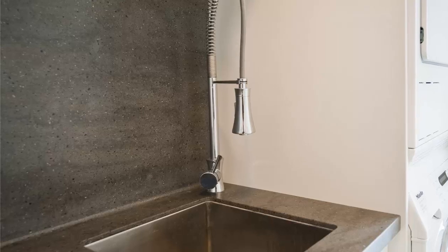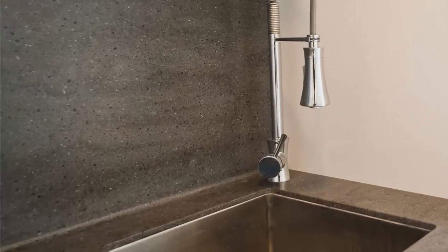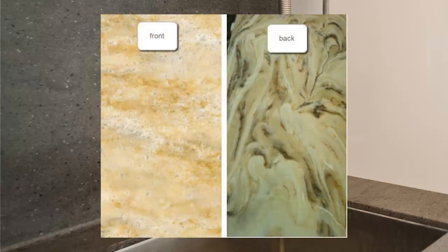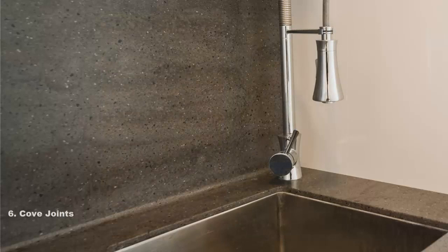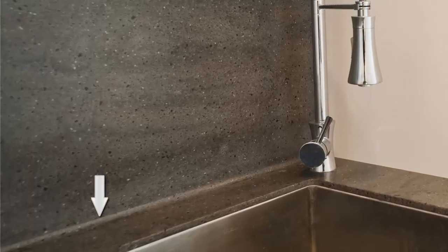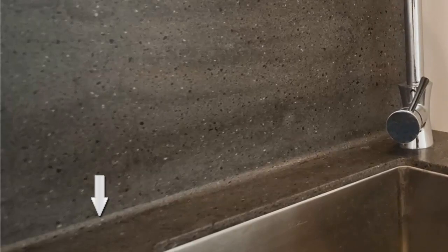The final consideration is going to require your interaction. Pause the video and select a sample from your library or showroom. Don't worry if you don't have a sample — I will also demonstrate with a photograph. Pictured here is Corian Saffron. The left side of the sample is intended to be face up; the right side is the back side. Notice how the colors are much more concentrated on the right. As we remove microscopic layer after layer, the concentration of the pattern gradually changes. Consequently, when a fabricator mills away the top surface, the visible pattern changes. This was first noticeable when we discussed edge details, but it is also relevant to cove joints. In this installation of lava rock, the integral cove joint is milled to create the nice, smooth radius transition, but if you look closely, you will notice a slight variation in the color and concentration of the pattern. This is to be expected and is a characteristic of the material. The same is true for routed drain boards and other three-dimensional shaping.